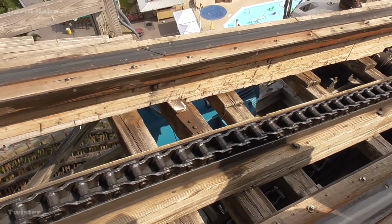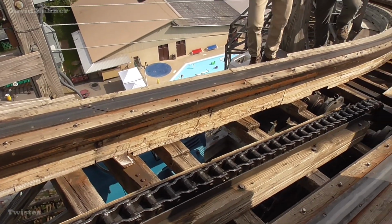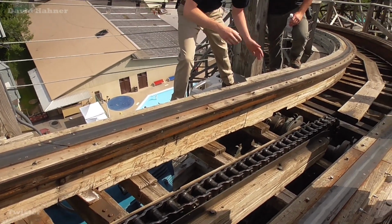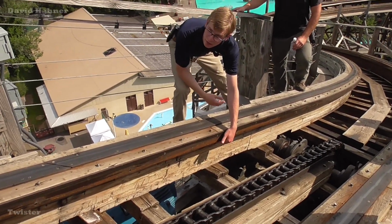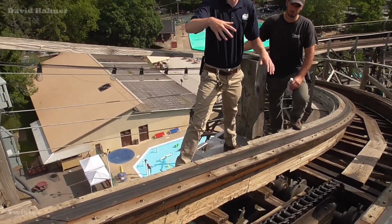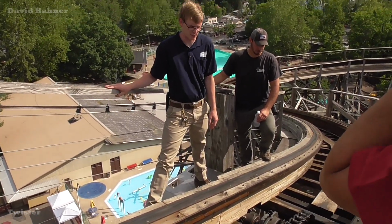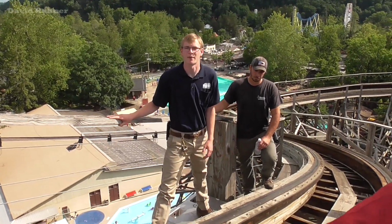You all have a fairly solid understanding of a wooden coaster, but there's 3 sections of track steel on these rides. You have your road wheel steel, of course, for your running surface, your side steel that keeps the train tracking in the correct location, and depending on where you're at in the ride, you'll have upstop steel to prevent the train from lifting up and out. Usually where any type of a dip comes up and crests, that's where you'll have your upstop, because that's naturally the only spot where the train's going to pick up with negative G's. Any positive G's where it's impossible for the train to lift at all, there's no need to put upstop steel in.